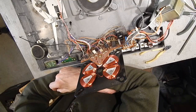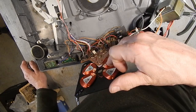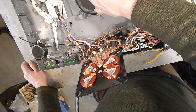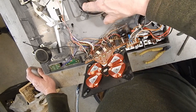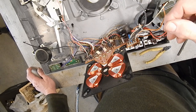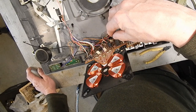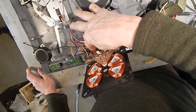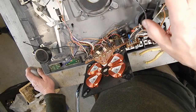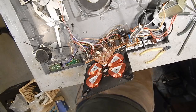Here's our board. These are our motor coils, and here's the magnet that drives the turntable. So this magnet and these coils are the entirety of the motor. Our problem has to be somewhere in this drive circuitry, and I'm suspicious of these potentiometers, so I'm going to clean those and wiggle them back and forth and then give this another try.